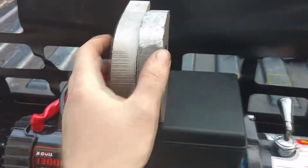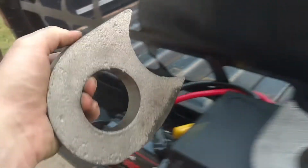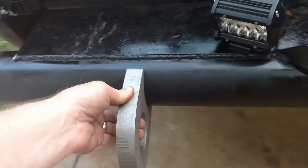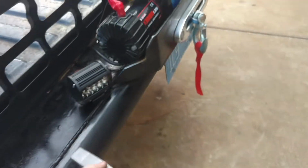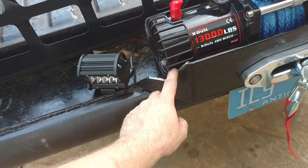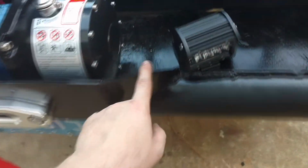And we've got these two pieces of steel. We're fixing to weld them to the bumper there. Big snatch points. Pretty simple. I think I already showed in the last portion, this big plate got welded on there. We did have to notch our original gusset here. Not too bad. All of that was 1/4 inch. We painted it all. Looks pretty good.